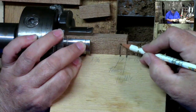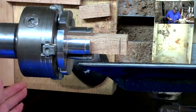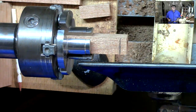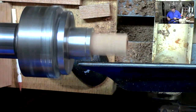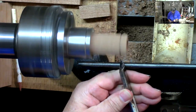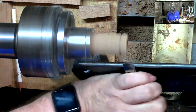This is the middle — we've got a place to draw a line right there. Now why do you folks think we might need a line in there? That's the recess for the top to fit down. We're going to make a little tenon on that to make it fit in the other end. I'm going to turn the speed up a little bit — remember, folks, we are spindle turning, so we can get away with a little more speed. I'm making sure the mark is where I want it, and then I come in and just do a thinning cut.